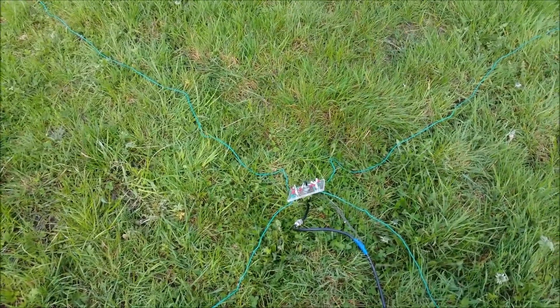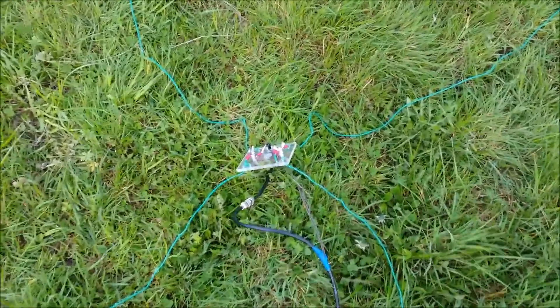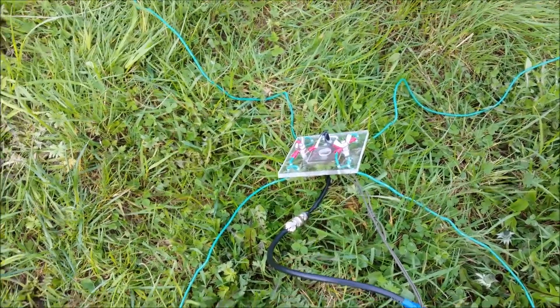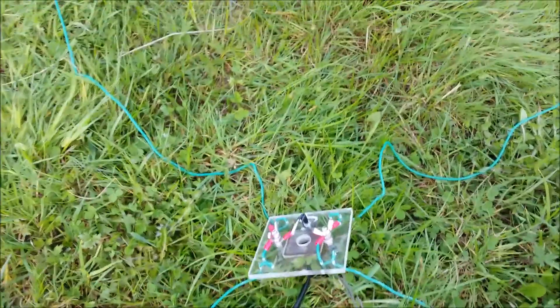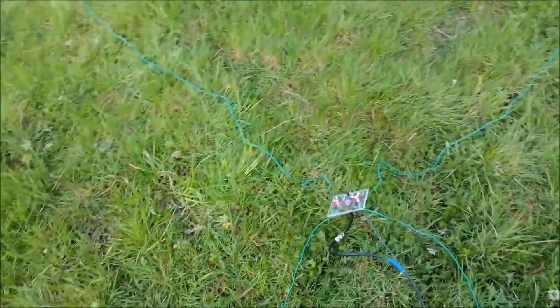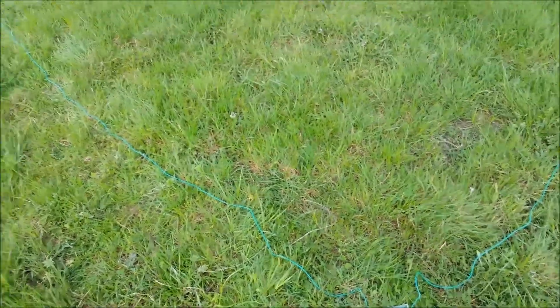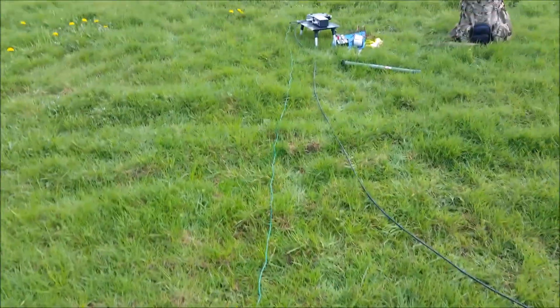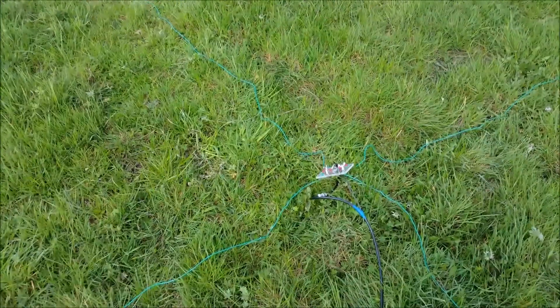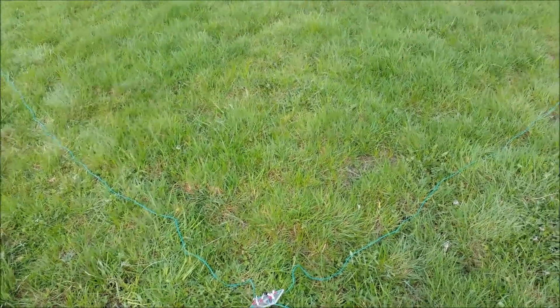I've got the antenna laid out and the coax attached. You can see I've got a strain relief on the coax so there's nothing actually pulling on the coax joint itself, or a lot of coax directly through that plexiglass plane there. The four wire elements go out — two at 25 feet and two at 37 feet. On the end of that we've got some 2mm paracord with a loop tied in at 45 feet. If we put a peg in at 42 feet and the mast is 15 feet up in the air, that should make all my triangles work out — a self-guying antenna system.